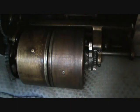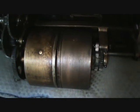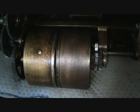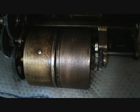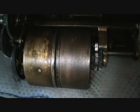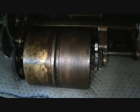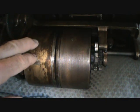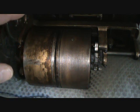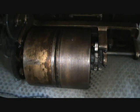There are very wide mainsprings in both barrels. After I have wound it sufficiently, I'll release the brake and you will see the left-hand spring barrel move but the right-hand spring barrel won't — but both springs inside the barrels are unwinding. If you ever hear any thumping and bumping as the springs are unwinding, it usually indicates old dried grease in there and the spring barrels have to be removed, the springs cleaned off with naphtha, gasoline, or lacquer thinner, replaced in the correct direction, and then re-greased. That should relieve all the irregular movements in the springs as they unwind.